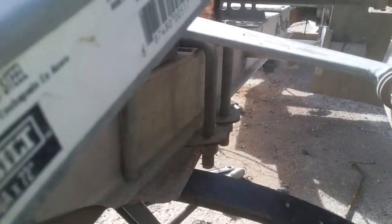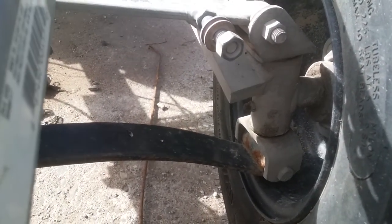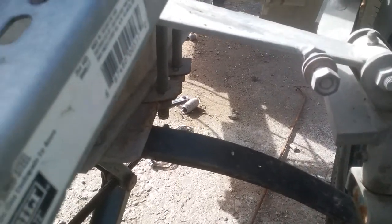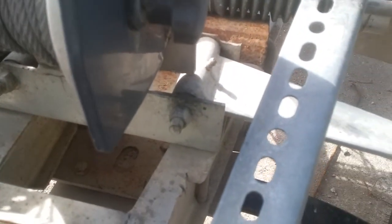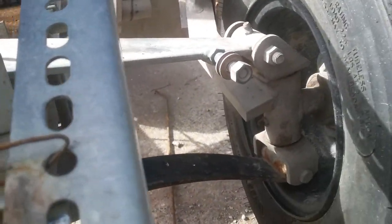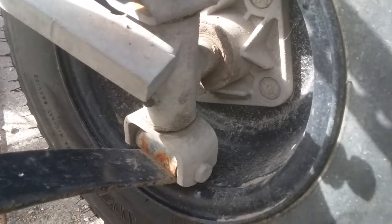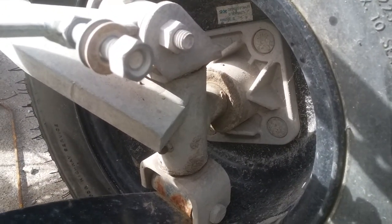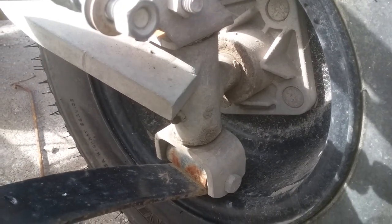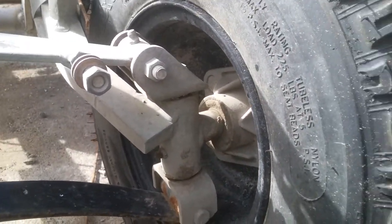Golf cart suspension on the front. Thinking about redoing this, using ATV A-arms, then remount things so I have brakes up in the front, be disc brakes. I'll have to get some adapters for those hubs to do that. Makes their different stud spacing.